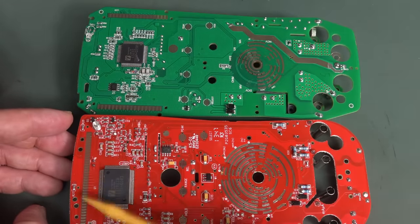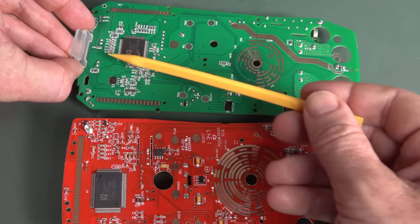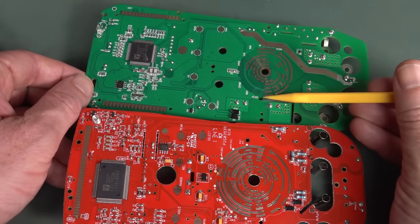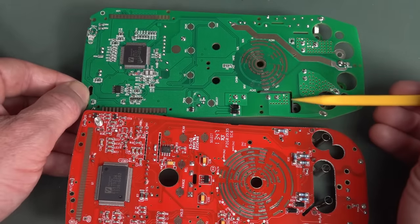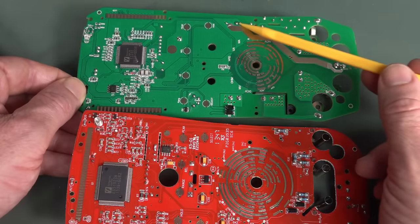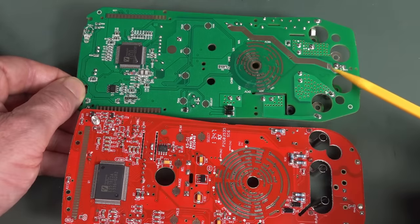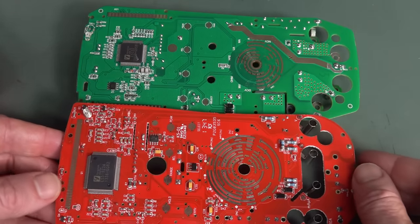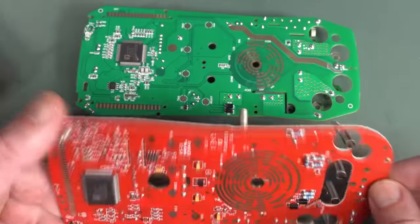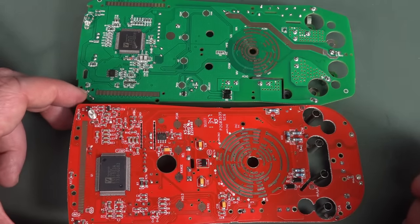The non-contact voltage lead runs into a light pipe through the front cover. They've put more attention to high-voltage isolation — a slot in the board and a plastic spacer between the range switch and fuse. There's a solder-coated heavy current trace running from the MOVs back to the common jack for fault current handling. Importantly, the new model has no calibration trimmer pots at all — the old one had pots for DC volts, AC volts, frequency, and capacitance. They're apparently relying on better reference components and divider resistors instead.